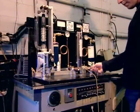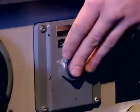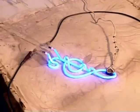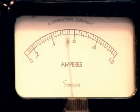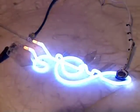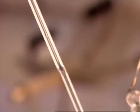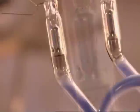They connect the electrodes to the system, then power it up. The pump vacuums out the air, then injects the gas. The electrical current makes the atoms in the gas glow. To trap the gas inside the tube, they use the crossfire burner to remove the tubulation and seal off the open electrode, making sure the drop of mercury has descended into it first.